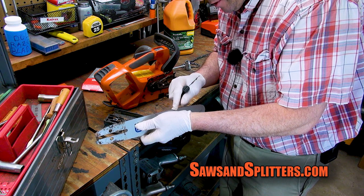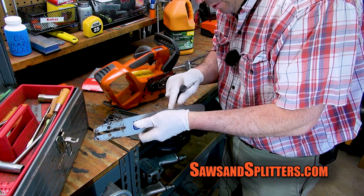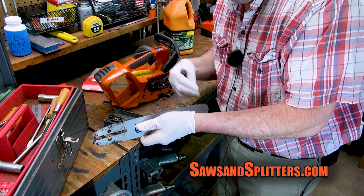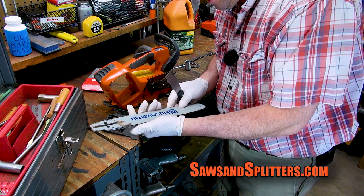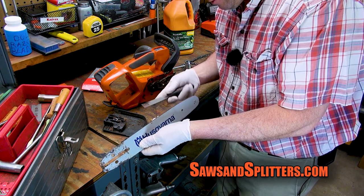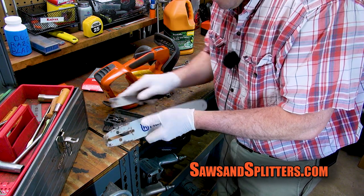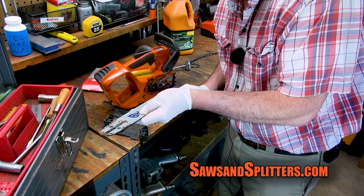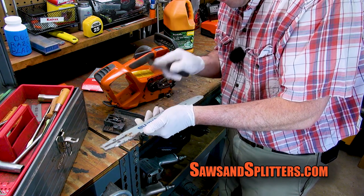And one time when I think I was in high school, we were doing something with the chainsaw, and the chain was getting really hot and sticking to the bar. So when we took it to the dealer to figure out what was going on, he basically was like, guys, you need to clean out this channel. So that's definitely something that if you guys use a chainsaw, you should do. Basically, anytime you take the bar off, clean that channel out.